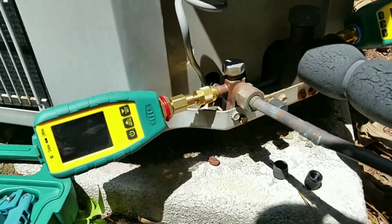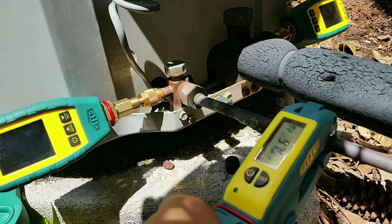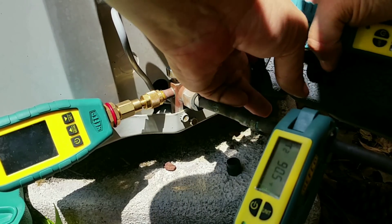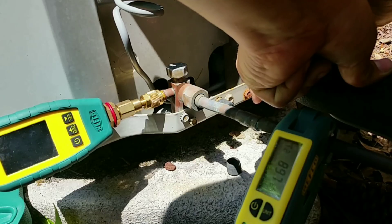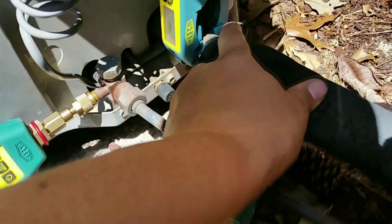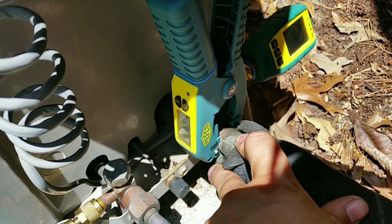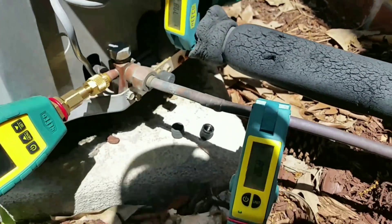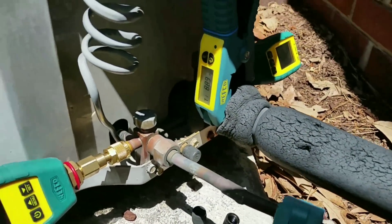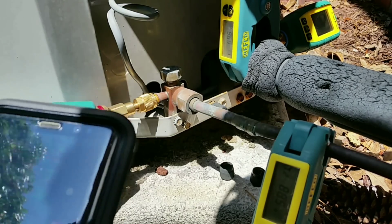We're reading pressure on both. Again I apologize, it's crazy sunny out here so it's going to be a little bit difficult to see, but we'll go ahead and hook up our clamps - our high side clamp and our suction clamp. These are fairly large clamps, so on this one for instance it's just able to get in behind that bell, just able to squeeze in between that bell and the service valve itself, but it does get on there and makes a nice fit. You can see it's pretty much steadied out on our temperatures - the clamps adjust the temperature really quickly.